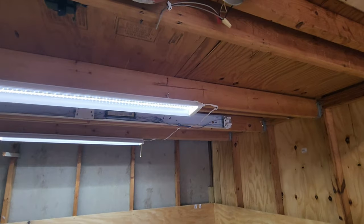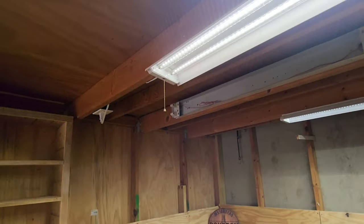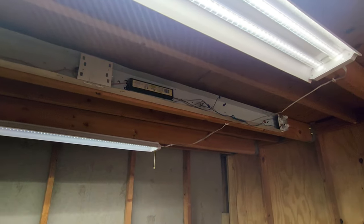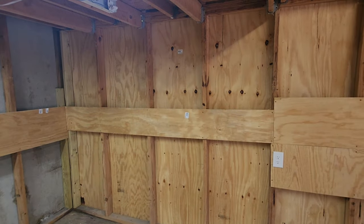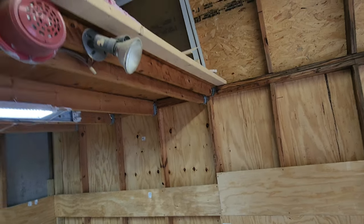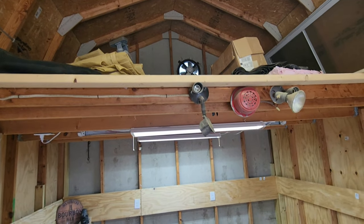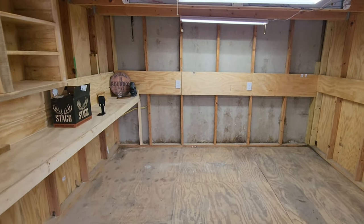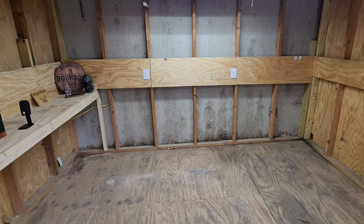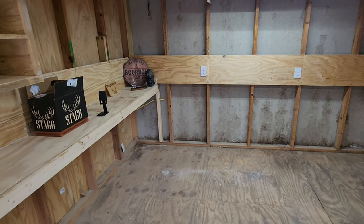For the roof, I think I'm gonna try to put some type of tin up there. There's a lot of interesting electrical work up here I'm gonna have to deal with — I've done some electrical work, and I'm probably gonna take a lot of this down. I'm not crazy about the lighting in here. So first project will be to get this place sprayed with blown insulation. That fan doesn't work — I'll need to replace it. There's also some rotten wood down there I may have to replace. I thought about pink insulation but I want a moisture barrier in here as well.